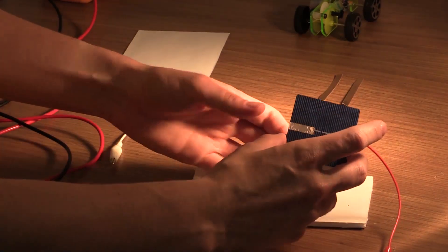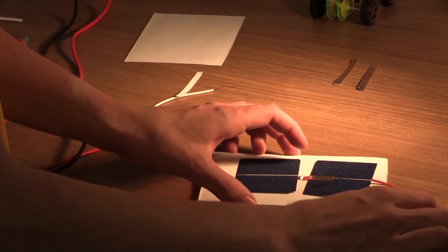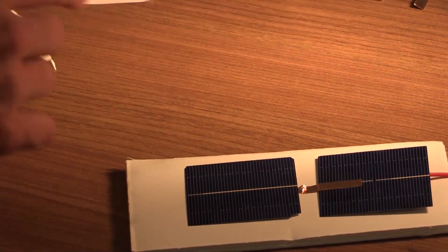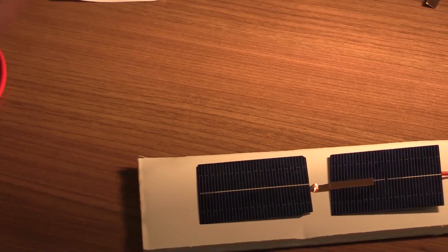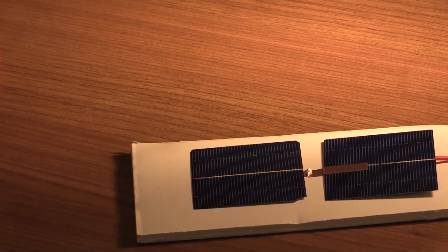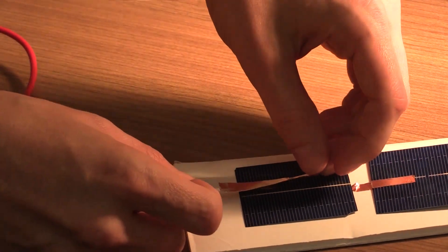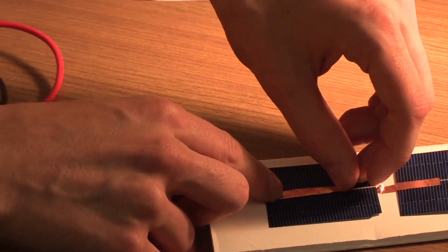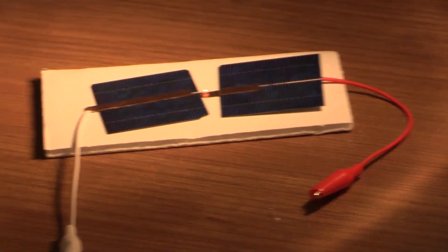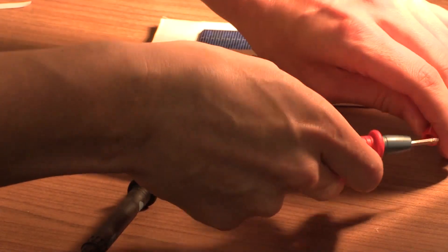We've now attached the front of our solar panel to the back of the next solar panel, and we want to make sure the copper tape doesn't end up sticking to the front side or the back side of our first solar panel. Now that our panel is connected, we can go ahead and attach our last wire to test our device. I'm going to peel off the copper tape again, attach it to the exposed copper wire on the clip lead, and then place that over the white contact on this solar cell.